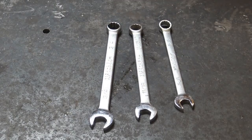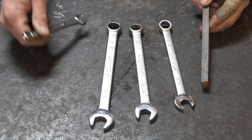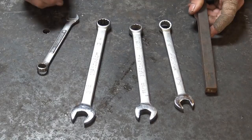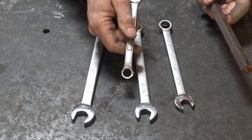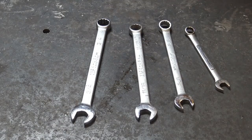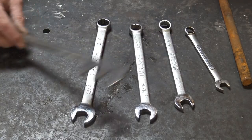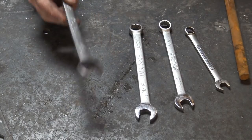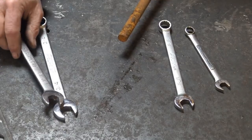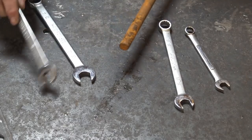They're all marked with what size they are. If you need one that is a half inch because you're trying to check if you've got a bar down to a half inch thickness, but you want that bar to be three-quarters inch wide when you're done — no problem, they make them. They even come with a handy little hang hole. For that project I mentioned, it's almost as easy to just have a three-quarter that has to fit smoothly and an 11/16ths that has to fit tight, and you can sneak up on it by checking measurements and get down to the final size.